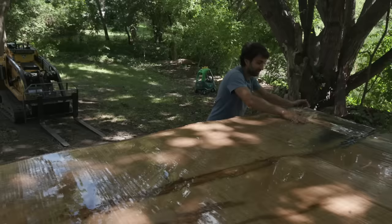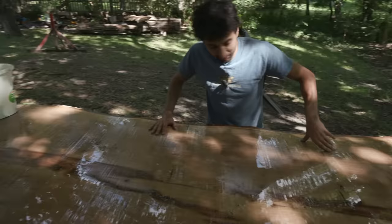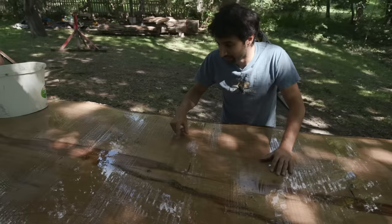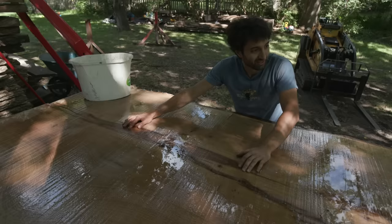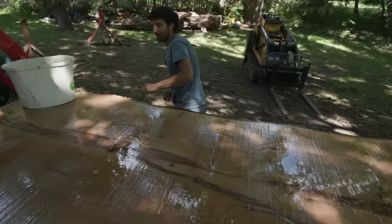So what we got here, we're pretty much getting outside the quarter sawn area now. We have some very small ray fleck, so the ray fleck is not as huge, much more subdued. I like this style of ray fleck a lot better than the true full quarter sawn, which is the giant ray fleck. A little bit of that original tree, the sapling tree here in the middle, which I think is really cool. And then there's this structural defect over there, but really straight grain stuff to the left and the right of the pith area. That's crazy.